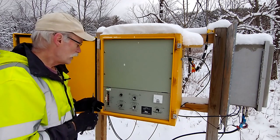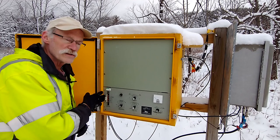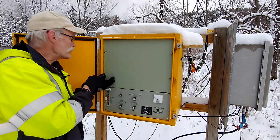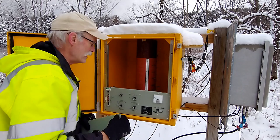This is a purely analog auto tuner. I have a sensor here, and this sensor measures phase and magnitude. And internal in here is a motor-driven variometer. Classic low-frequency installation. And the variometer is at the bottom of this tuning coil.